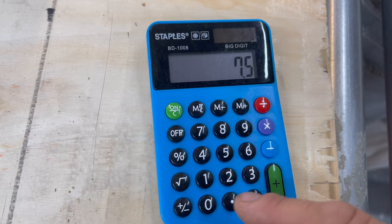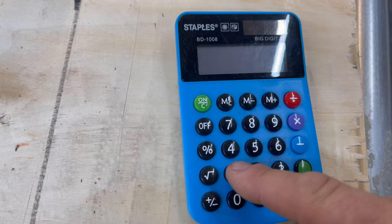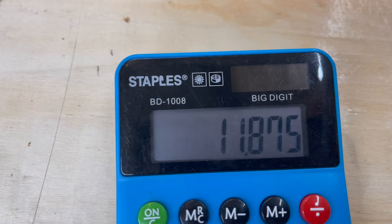Jody's got 6.5 and 7.5. The normal stair is about 18 inches, so when I do my math I usually allow 19 inches times the amount of stairs. So 19 times 7.5 stairs: 7.5 times 19 inches divided by 12 per foot equals 11.87. So basically she needs 12 feet for her first staircase.